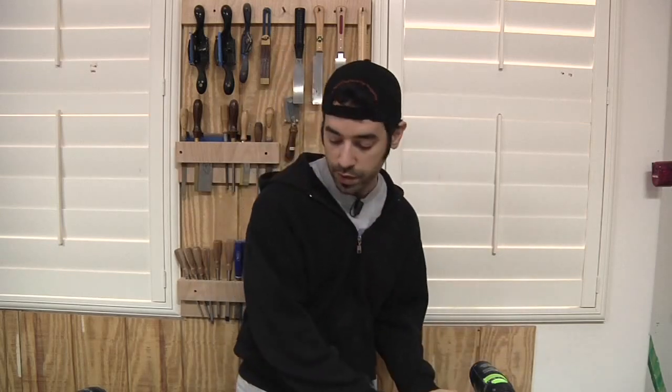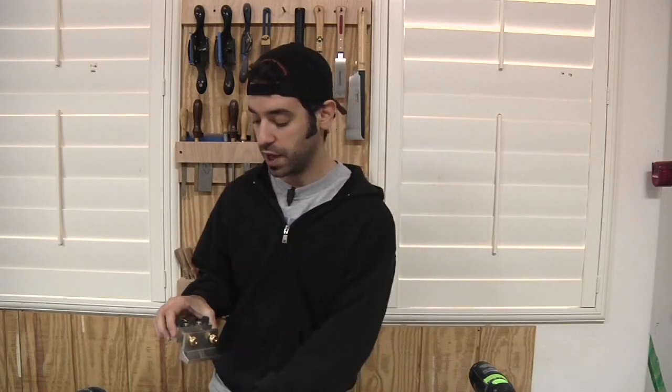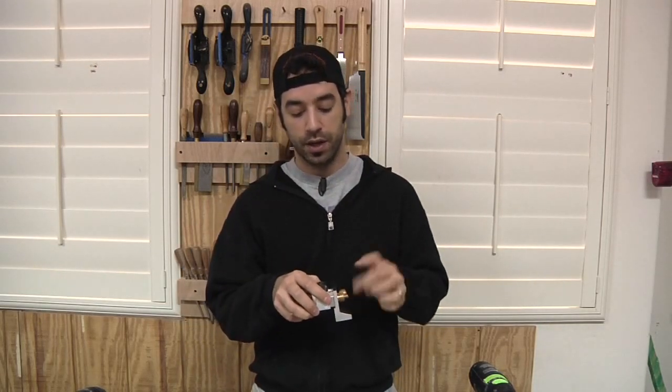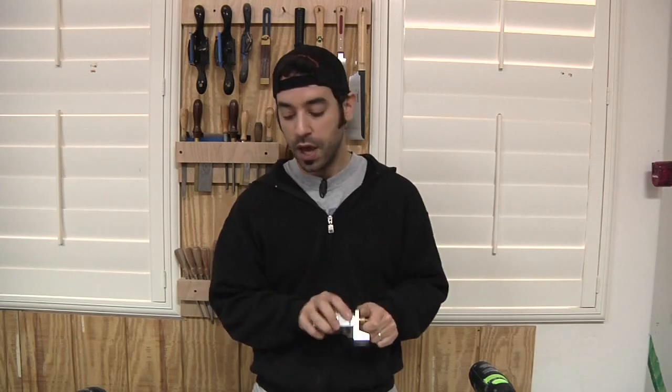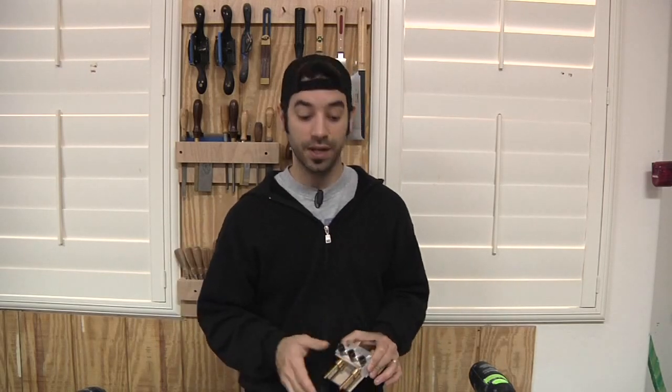So this big spacer that we used here is going to be a little bit too much. Now, fortunately, they have multiple spacers that you can use. This is a much smaller spacer at about a quarter inch. Pop that guy in there, and now I can do those top joints. And as long as I have my check marks in all the right places, which I could do as the very first step on all of my work pieces, I can go back through and get them all done and drill them all at the same time.